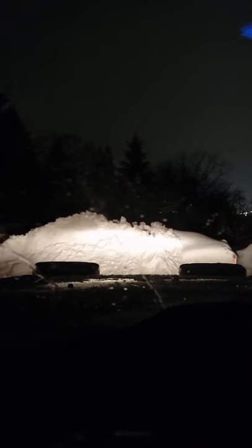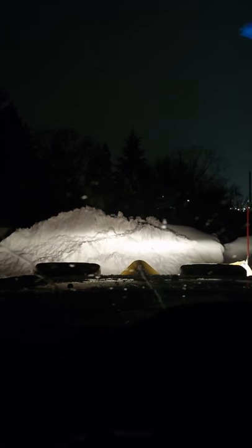There's a couple drains along there too, which is handy, so I don't end up dealing with a lot of runoff. You don't want to push that snow to a high side of the laneway. You always want to put it to the low side, because you don't want to deal with runoff ice every night. If I pushed it to the left side, every sunny day some would melt and run across the roadway, and then every night I'd have to come salt that ice when it freezes back up. If you push it to the low side, on the drainage side, you don't have that problem.